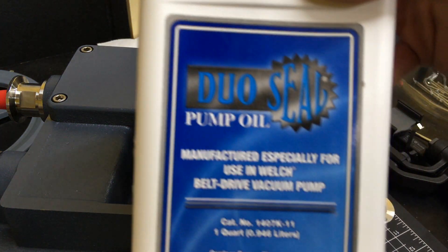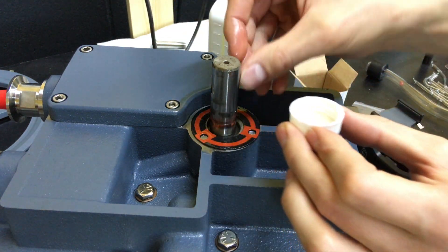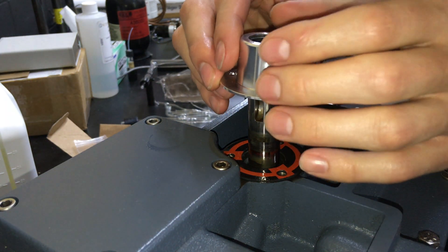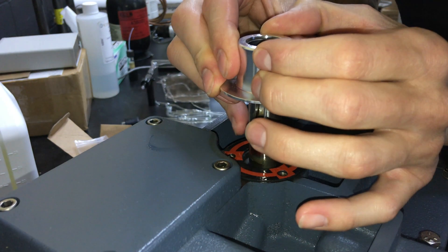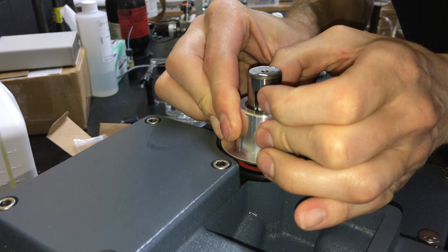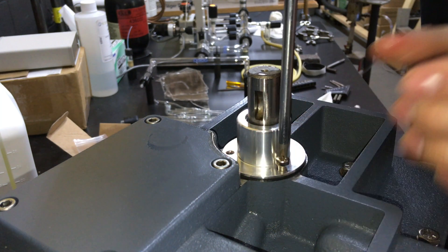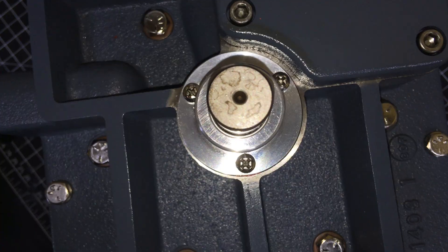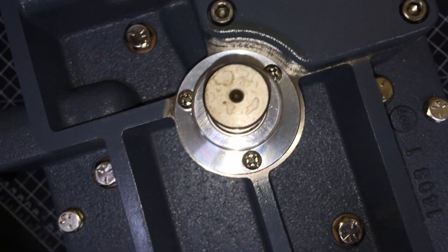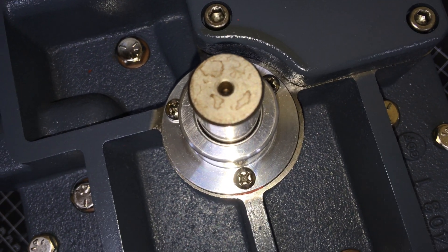With the sealing surface cleaned and prepped, I thoroughly moistened all the surfaces with pump oil, and then slid the seal onto the shaft. I tried to apply pressure to the side of the seal opposite the slot for the Woodruff key, to keep the edges from slicing into the new seal as it was installed. After aligning the holes in the gasket and the seal, I loosely threaded the screws and then checked the alignment of the seal around the shaft. There was no feeler gauge included, so I just eyeballed the gap to make it as even as possible all the way around. I don't even know if this step was necessary, but I figured it couldn't hurt.